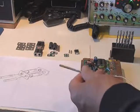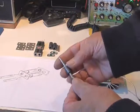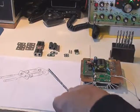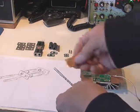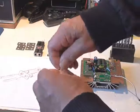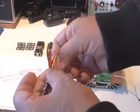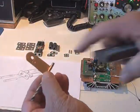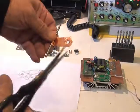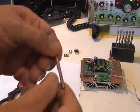So the first thing I do is take a drill. This happens to be a 4mm drill, and I notice it enters the tube quite freely, so there's enough room for the copper foil to be wrapped around the drill and form a tube. Basically what I do is put the foil around the drill like that, then snip the copper foil at the right spot with a pair of scissors, and I've now formed a tube.